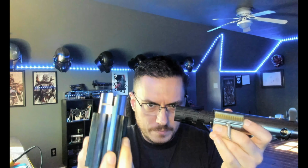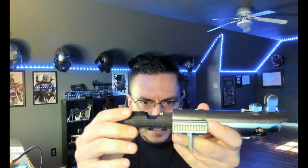You can see it. But once you take that out, this is your chassis that I came up with. This is an older version of my chassis that I just kind of took and made some tweaks on. Trying out some different things just to try to make my stuff a little bit more unique in small ways, right? So you can see your Proffie board here. You got access to your SD card and your micro USB. You never have to move the board. It is a snap fit down into the shelf, but if you find that in the future it's popping up on you because of lifting it or whatever, you can use a little bit of E6000 on both sides and put it down on the shelf and let it cure, and it will stay there. But for right now, it's super firm, and there's no need for that board to ever come up, right?